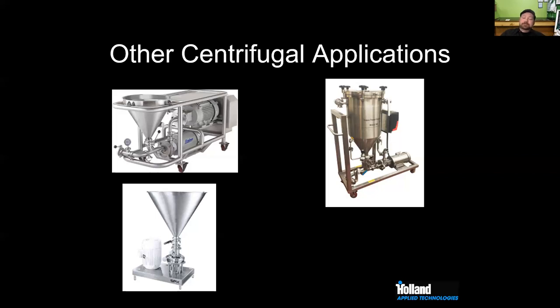Very good. We did have one question from Ashif, who's joining us today. He asked, what pumps, is it an issue to run dry, and what are the consequences of running dry? Off the top of my head, centrifugal pumps are ones we see issues with running dry, for sure. I think that happens a lot in some of these craft brew systems, and people will toast their seals, basically. You'll wreck the mechanical seal. PD pumps, really any pump with a mechanical seal, you're going to have an issue running dry.